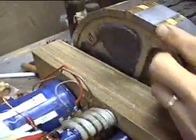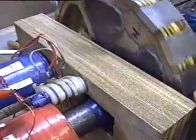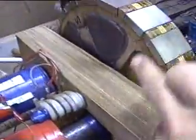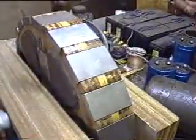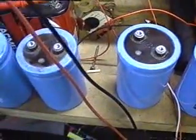It's manganese steel with a high manganese content so it's not very magnetic. These are my drive magnets here — there's a north and a south. They just pulse around in front of the electromagnet there, and they're attracted to the electromagnet cores. This rotor weighs 11 kilograms, or almost 25 pounds, so it gets quite a momentum going.